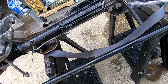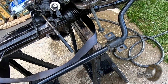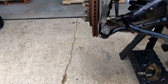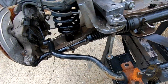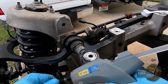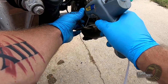A lot of the stuff on this crossbar we're not going to use anyway, so we'll just go ahead and tear it off after we get this all cleaned up. Now that's setting, we'll take and plug up some of these hoses as well. Brake calipers are still good, otherwise we're just going to have to replace them for now. These hoses are done anyway, so we're just going to plug them shut to keep the moisture out of the calipers.